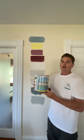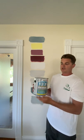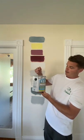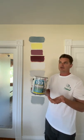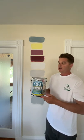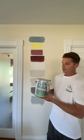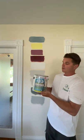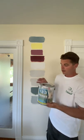You can buy this at Home Depot. The great thing about this primer is it comes white or gray — it's a stock gray, so you don't have to have the people at the paint store tint it. When it dries, it dries to just slightly below an eggshell sheen, so whatever paint you put on top of it glides really nicely over the surface. It's right around the $30 mark.